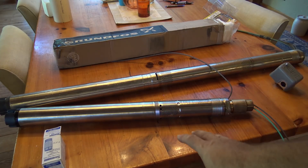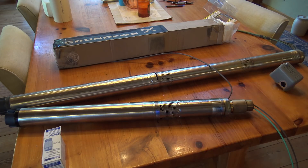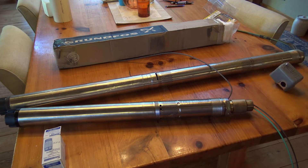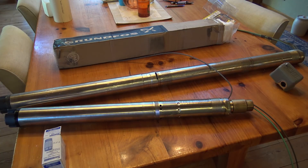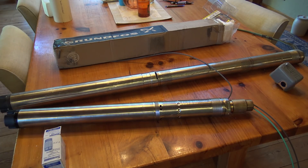This pump has a lot of capabilities and we have them on our website, or you can call me — I can ship these pumps anywhere in the country and I'll give you a really good price. This has just been my go-to. If the well water is very deep and I can't meet the pressure demands with this pump, I'll switch over to my AC/DC pump — the Grundfos SQ Flex series. There are 11 models; this is an 11 SQF2. The 6 SQF3 will pump from 840 feet static at five gallons a minute with solar, no batteries. It's awesome.